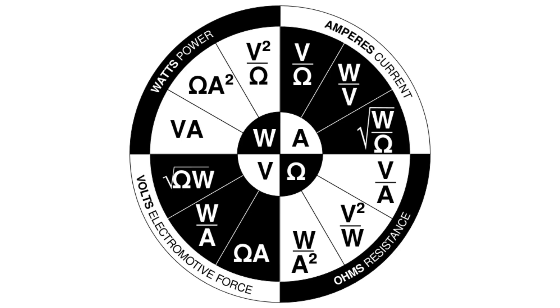Our formula is watts equals volts times current, so current equals watts divided by voltage. If we have a pedal that requires 10 watts of power, that's 10 watts divided by 9 volts which equals 1.1 amps. That's quite a high current for a pedal power supply. If we increase the voltage to 18 volts then that drops the current to just over 500 milliamps, which may be easier to handle.